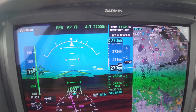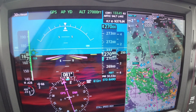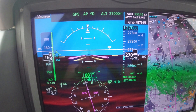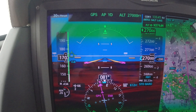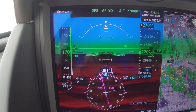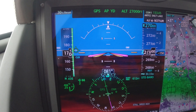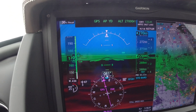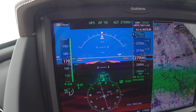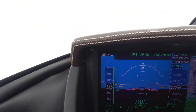So we're gaining some altitude and losing some altitude. Where that becomes really critical is if you're in the RVSM zone, which is above 29,000 feet — you have to maintain within 200 feet of your assigned altitude. So if you cannot do that, you need to advise ATC. This aircraft only has a certified ceiling of Flight Level 280, so we're not in RVSM anyway. But that's the Wing Stab IPS system — the pneumatic boots for the leading edge of the horizontal stabilizer and the wings.